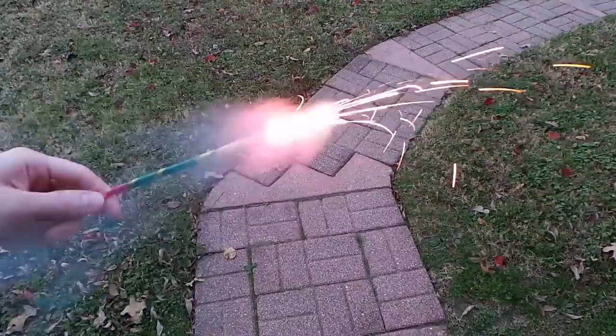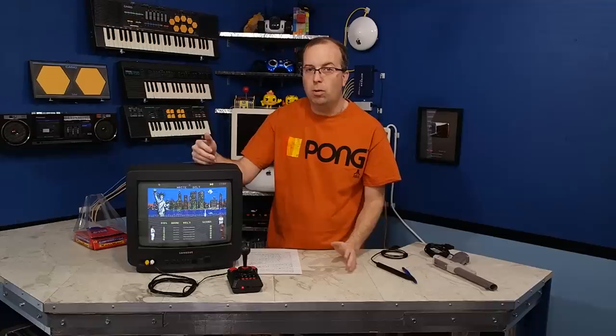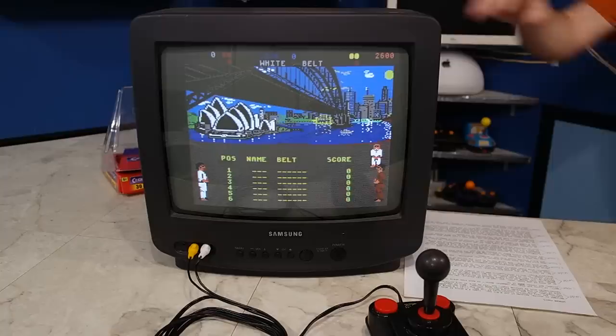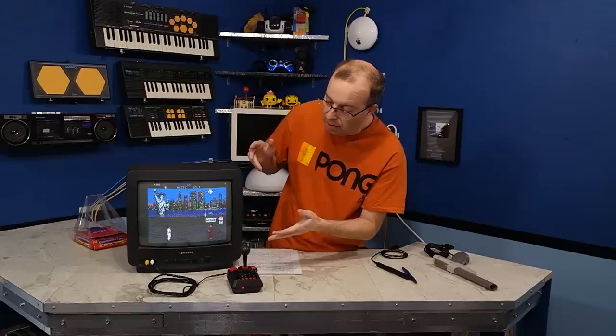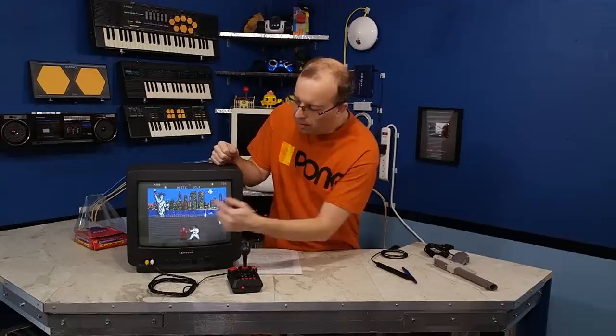This is similar to how at night you can see a sparkler or flashlight make circles that look coherent, even though the light only exists in one place at a time. As a result, it's actually pretty difficult to capture stable images on a camera — you're probably seeing some scrolling line moving across the screen which I'm not seeing in person. That's an unfortunate result of the timing between the camera and the CRT. So in reality, at any given microsecond, there's really only one pixel lit up on this screen.